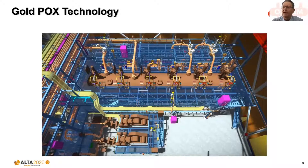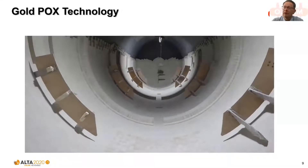What does a circuit look like physically? Here's an example of a recent POX circuit showing the autoclave feed pumps at the bottom left, the autoclave at the top of the screen with feed going right to left. We can see a pair of feed lines, agitators on top of the horizontal cylindrical pressure vessel, and discharge lines on the right-hand side. Inside, there are three layers of brick lining to protect the membrane, which is the corrosion barrier protecting the carbon steel shell. We can also see partially installed anti-swirl baffles.